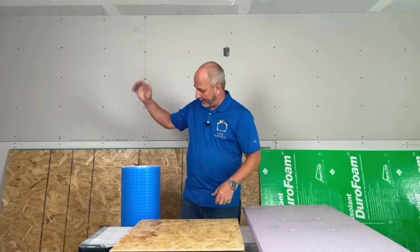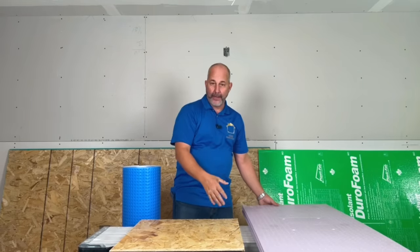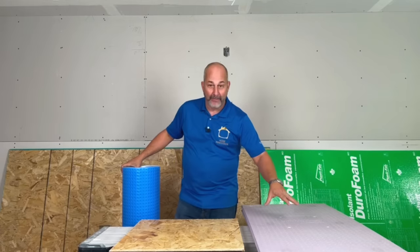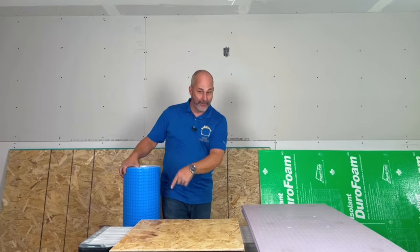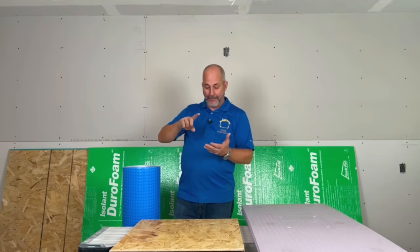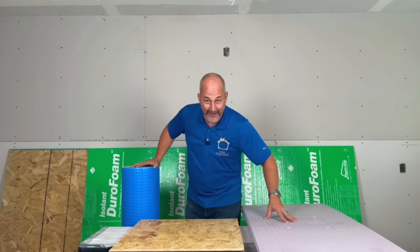If you're looking for just a little water management and not too worried about a thermal break, the DMX One Step is a great cheap option. The newest invention — the insulated dimpled panel — gives you a thermal break, water management, and it's lightweight. This is why celebrities are endorsing these branded products: they've got a trademark and a picture on the box. But systems like the foam-plus-OSB approach, nobody endorses because no one's getting paid. The truth is, as a contractor, I'll take foam and OSB over one of these branded products any day. When I install this, I know I'm getting a perfect moisture lock and more value — more insulation, more capability, and better quality from building materials. That's why I don't have a sponsor for this video: I'm just telling you what I actually think.